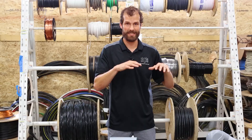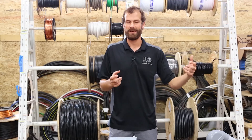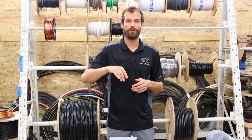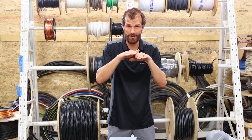Backfill another 12 inches, tamp it down, then another 12 inches and tamp again. You will end up with excess dirt because the fill will never be as compact as the original soil, and the electrical installation physically takes up space. Have a plan for removing spoils from the site, and keep that trench up just a little bit high because you know it's going to settle.